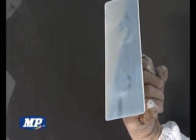When rasato di calce fine is quite but not completely dry, apply Marmo di Venezia using a stainless steel trowel with rounded corners, by little overlapping touches of the trowel, filling then the empty spaces in order to obtain a homogeneous surface and the classic stucco a calce decorative effect.